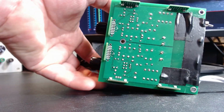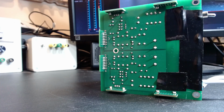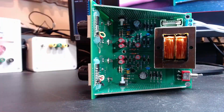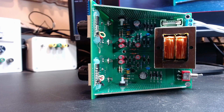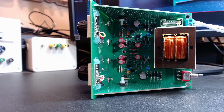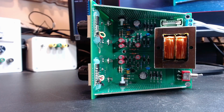But soldering the circuit boards together like this is not exactly unique, because we do it quite often in industrial gear. So we'll have multiple circuit boards that do get soldered together, and you end up with creating the case. So I'd like to take credit for coming up with this idea, but unfortunately, I have seen it in PLCs and industrial gear. So definitely a lot of soldering. Only a few unique components, but a fair number of them. For example, I believe there's 24 1N4004s or 1N4007s diodes. So a lot of experience soldering. That's fantastic. And as you can see, these optional voltmeters, just hot glue in. Absolutely nothing high tech about this. Anybody with a soldering iron and a hot glue gun should be able to put this together.